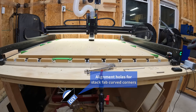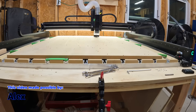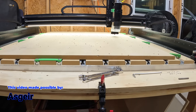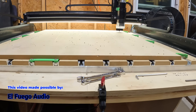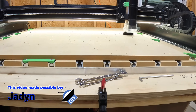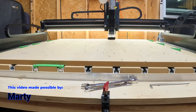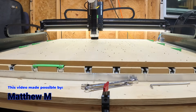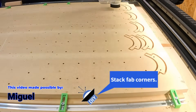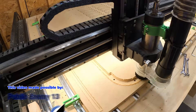You can see the machine is bobbing up and down on the z-axis — this is a drilling procedure where the bit is pecking down an eighth of an inch and then retracting to clear out any trash. I've got it set up to do the drill cuts first because they don't do a lot of damage to the work surface, so the board still has quite a bit of integrity and I don't have to worry about it flying loose while it's drilling. On this one piece I've got to drill out 57 precision holes, which would be very difficult and time-consuming with a power drill. All the cuts on this one board could take up to an hour and a half, so put on some hearing protection if you're going to stay in the room, and use that time to work on something productive instead of just staring at the machine.